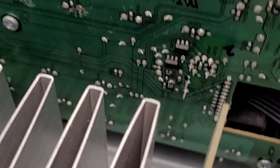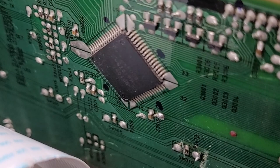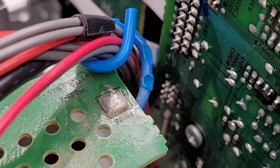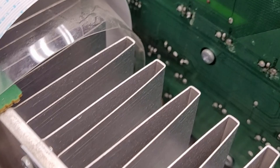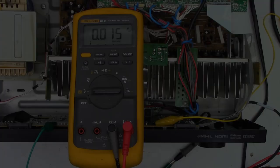A little bonus footage — more evidence this thing's been worked on before. Take a look at this ribbon cable: it's been melted. And these switches have definitely seen some solder work in the past. It might be a refurb unit, I'm not sure, but the telltale marks tell me this thing is not a virgin.